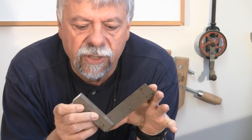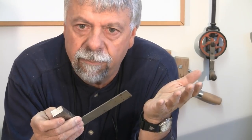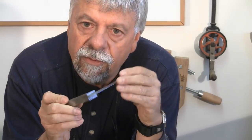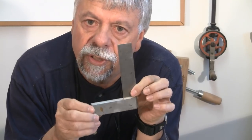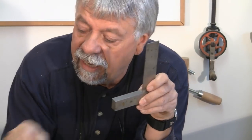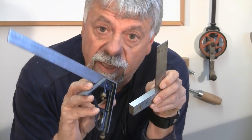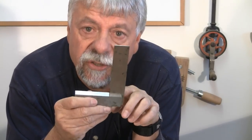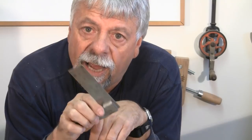This is my little engineer's square — I think this is a 5 inch by 3 inch. They come in different lengths. I keep threatening to get a bigger one, but I seem to rely on my other two. For setting up machinery, for setting up fences, particularly setting up jointer fences, this is the kind of tool that you need. If you're relying on a tri-square, you might not be getting absolutely accurate cuts. My tri-square was not a cheap one — it was an expensive tri-square — but when I check it against this, it's not as accurate as a steel-to-steel engineer's square. They're always dead on. They'll last you a lifetime and cost you a few dollars. Whenever you use it, you know that whatever you're marking is absolutely accurate.